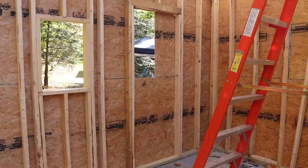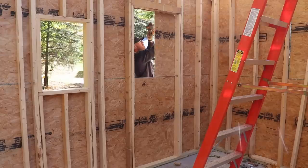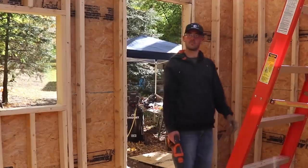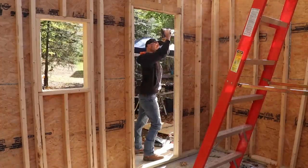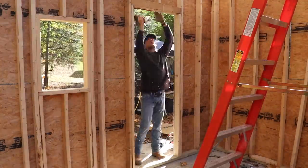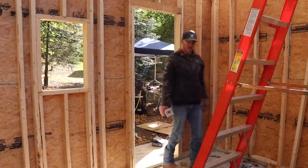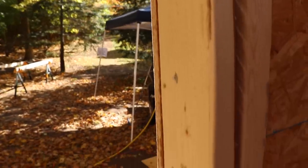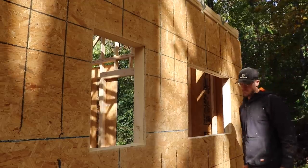For the door, I tried a circular saw for the long runs, the reciprocating saw for the short runs and to clean up the corners, and then a final pass with the trim router to clean it up. I like this method best. I know there are some out there saying you're just roughing it — it doesn't need to be pretty — which I totally get, but I also just want it to look nice. After getting all of the openings cut, we can move on to the next step.